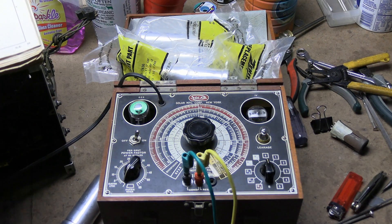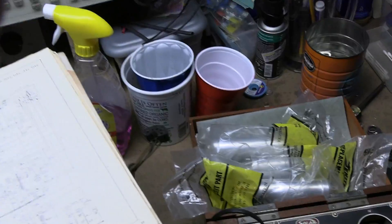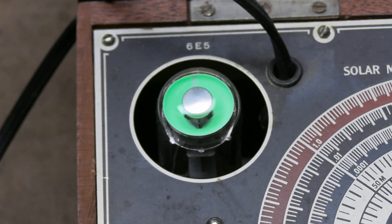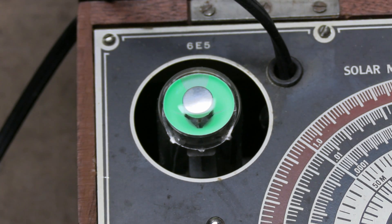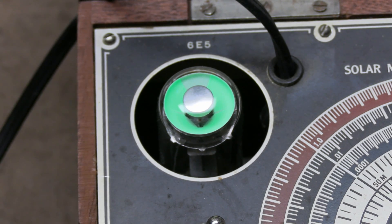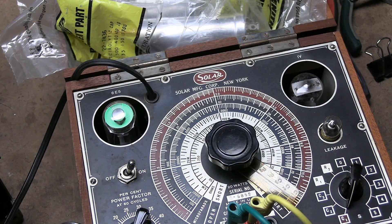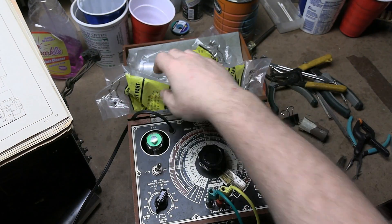For that I'm going to go to the C1 range. Zoom in on the eye tube here. This capacitance meter — 80 is kind of pushing what it can go up to. The last mark on here is 70, so the 80 is going to be right near the edge. And yeah, we get that pie wedge going. It's a little off scale, but that's about where I would expect it to be — it's near the end of the max mark on the scale. So this cap seems to be okay.